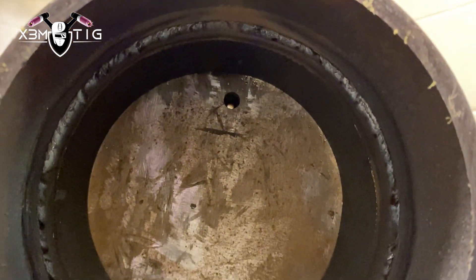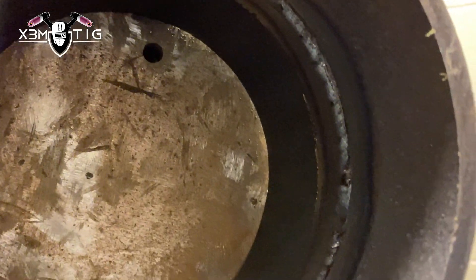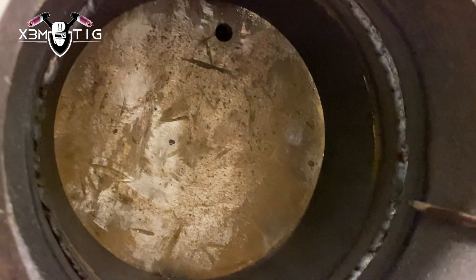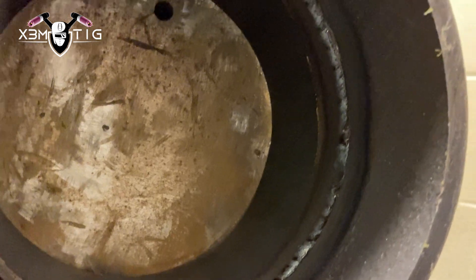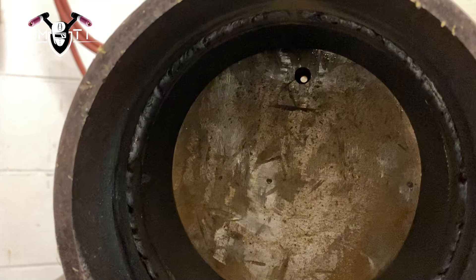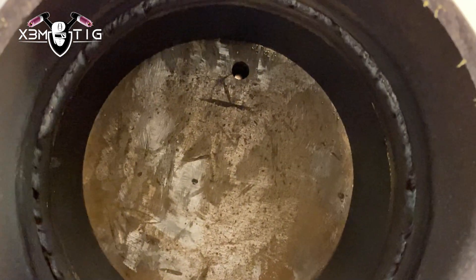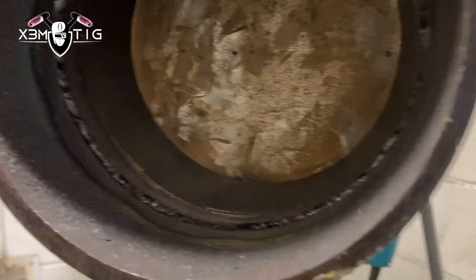The key is to stretch that puddle as wide as you can to prevent any puddle material from sagging down or creating grapes. For the tie-in, just pause over there and add wire — that should be good. This is the final product with the back feed technique; this is how the root should look. With this kind of root you don't have to worry about suck back. I pulled out a little bit early on one spot, so the thickness isn't quite even there, and one little section is a bit heavier — but everything else is good, and even with that it's a good root.